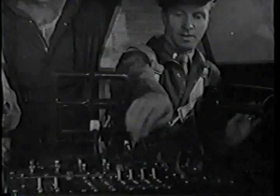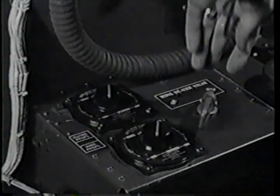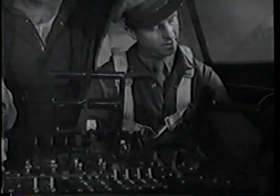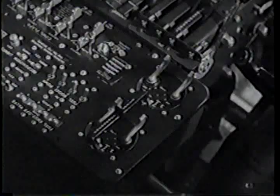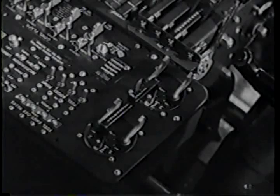See that all other switches are off before turning off the batteries and the main line. Booster pumps off. Landing gear, wing flaps, neutral. De-icer, anti-icer, off. Inverters? Inverters off only when the instruments have returned to neutral. Inverters off. Batteries off. Mainline off. Lock control surfaces.